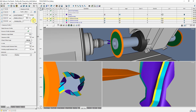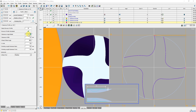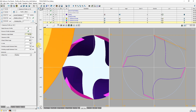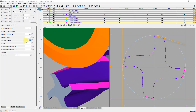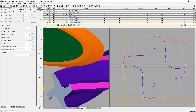To illustrate this, I have defined a single horizontal line on the tool. Since the geometry is created with the diameter of the grinding wheel, a slightly hollow grinding is produced. This is smaller the larger the diameter of the grinding wheel. The generated clearance angle corresponds to the angle entered when the grinding wheel is positioned 90 degrees to the profile element. In any other position, the angle is smaller.